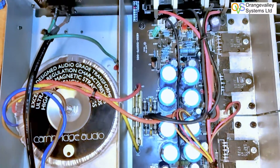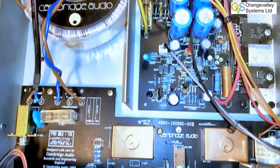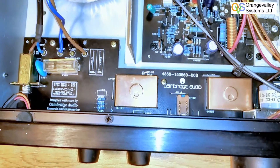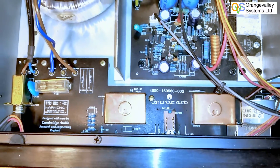Obviously something is dead. Looking at the power supply, we've got the mains going in, which goes onto this little board at the front — the switch. I've tested the switch and that works okay, and the fuse on there is also fine.